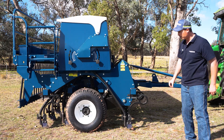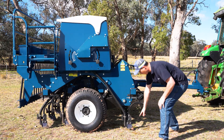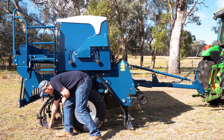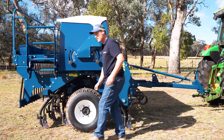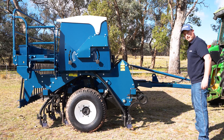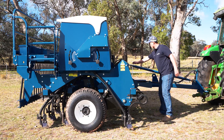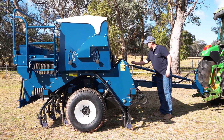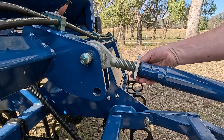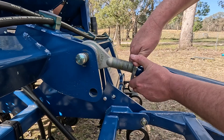There we have the machine being levelled. We can see the height from our front point to our rear point to the ground is now equal. So our machine is now levelled — we need to lock up the levelling tube. We do that by screwing down the locking nut and locking it in tight.